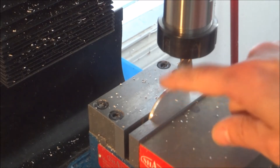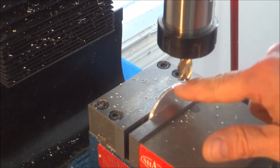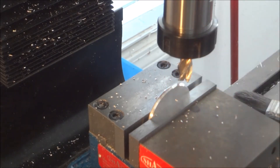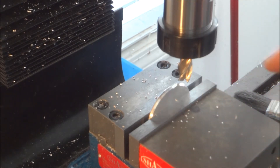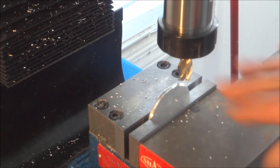I've got my stock in here, clamped up, and the depth set. I actually started cutting before I realized I wasn't videoing. I'm just going to go back and forth and get this down to about an inch and a half for the total width, and that should be good. Once I get this flat, I'll flip it over and put that flat on top of the vise base so it'll be lined up parallel.